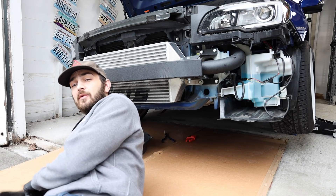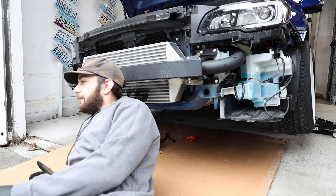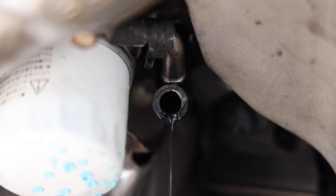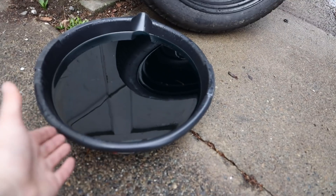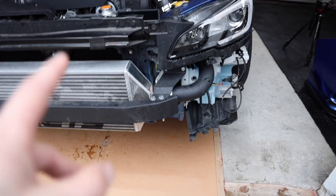Just like last weekend, I'm going to drain the coolant off the oil cooler to get all the coolant out of the channels in the engine. After I get it drained, I'll bring the camera up and show you guys what coolant line I'm talking about. That was a lot of coolant — a little over a gallon came out. I'm not going to reuse this; I'll dispose of it at a local auto parts store. Be kind to the environment — don't throw your coolant in the dirt. Now we're going to go find that plug location and start pulling it out.